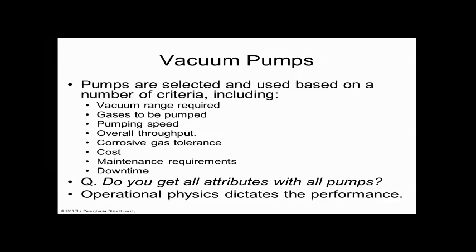And when you take classes like this or go back to college and learn vacuum technology, I teach vacuum technology here at Penn State and online, right? Like to you guys, right? So, you know, you take classes on this and then you could pick the right pump for the right application. Does that make sense? In fact, this is kind of crazy. Let me throw this thought out at you. If I had the same machine, identical, ran the same gases, identical, and then I changed the pump from one type to another, my product will change. Even though they pumped down to 10 to the minus 6, it'll change the product.